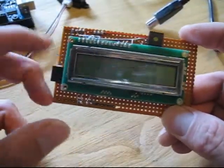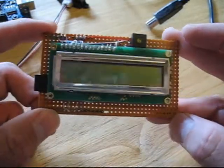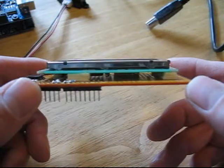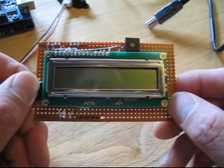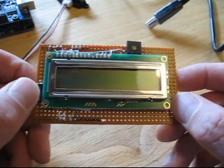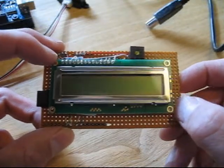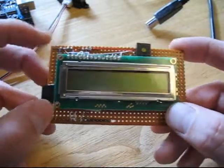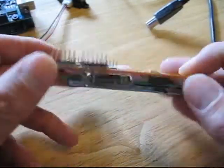Of course, it's only a voltage — I don't think it's proportional, I'm not quite sure. Now what I've made here is a shield. This is a liquid crystal display that I got from an AT&T phone, and it was junk, so I took it apart and found that it is an HD44780 compatible display. I was able to find a datasheet online — it's an M1641 display unit, which is pretty cool. And I did some soldering to this board to make a shield.